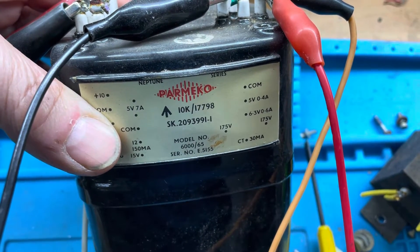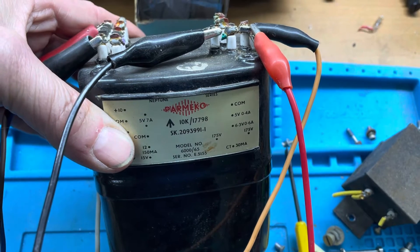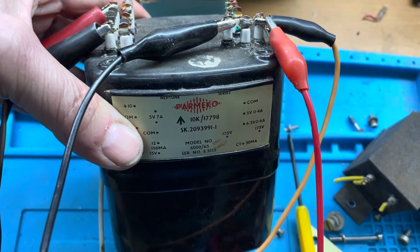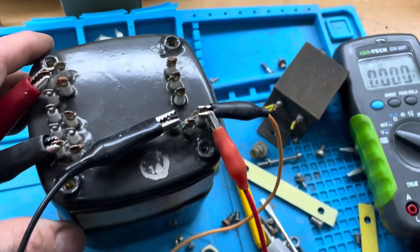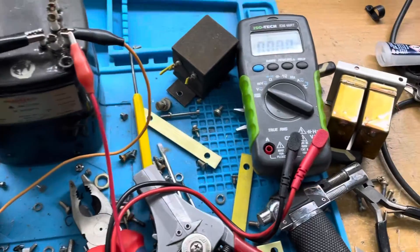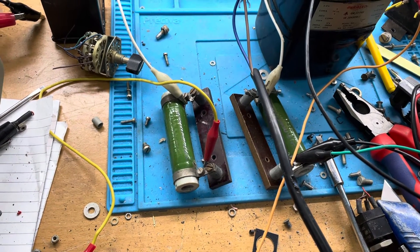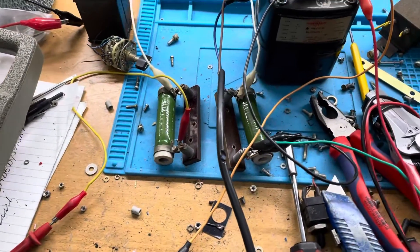As you can see, it's rated 175 volts at 30 milliamps. Given the size of it, I would have thought it'd be capable of handling quite a bit more current than that. I have experience of previous transformers like this and I believe they are quite substantially underrated — that 30 milliamp figure is probably continuous duty within spec. So what we're going to do is rig up a little test: I've got the transformer, I'm measuring the voltage across it, and I've got a couple of chunky 2k resistors — 4k total as a load — and we're going to measure the current going through those.